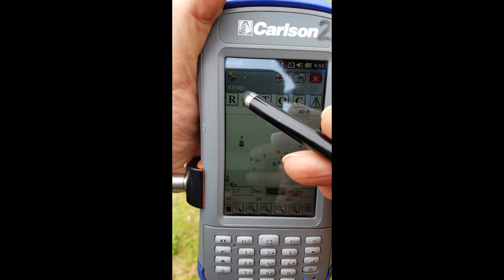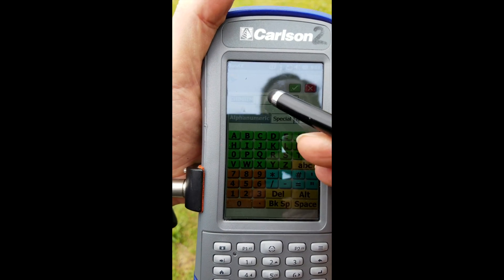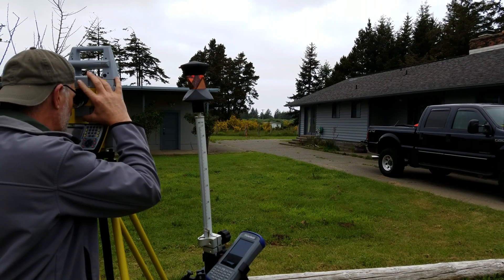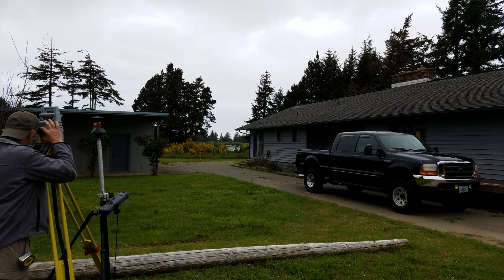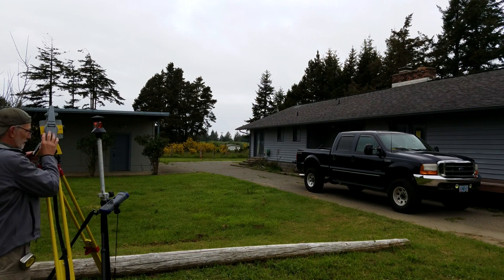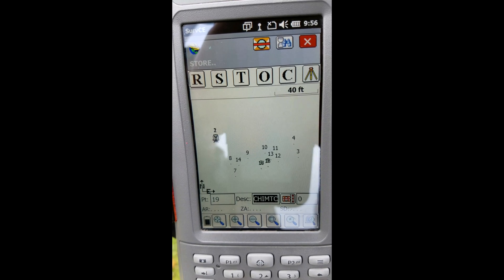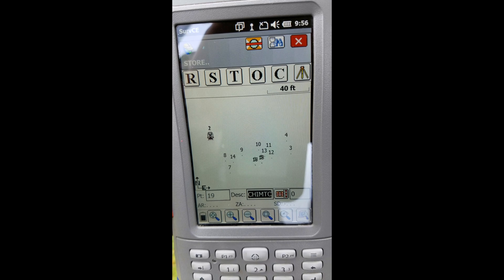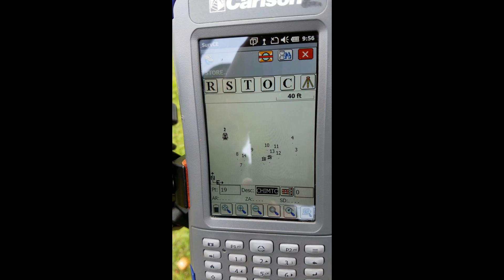Just under the ridge line cap — that's our first measurement. Once we're focused on a point, we simply hit S for store. The data collector gives us the opportunity to change the description. We're turning to another point on the roof to pick up another corner now. We can measure to asphalt shingles, plastic plumbing vents, or other types of infrastructure — any surface that has any reflectivity. It's a very quick way to accumulate data for the as-built so we can build a design on top of that. And there are all of the points for the roof — the four corners, the ridge line perimeter, the bottom edge perimeter, and all of the plumbing vents. Now we can go and design on that surface.